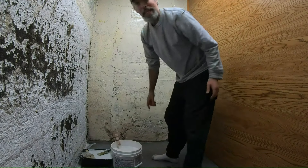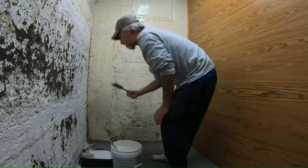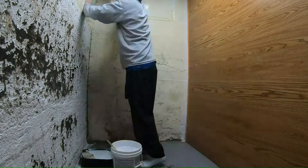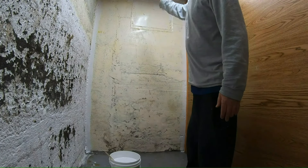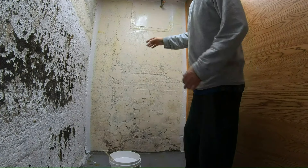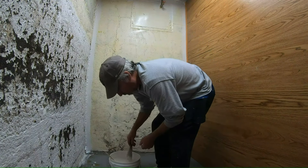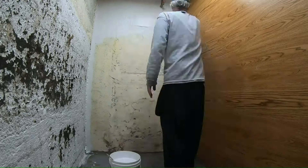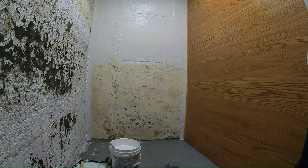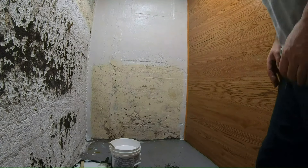YouTubers, I'm going to paint — I'm going to time lapse it, so maybe I'll paint faster. Starting with Drylok to try to keep the water seepage out. You could actually get away with using a roller on this wall because it's relatively smooth, but on rougher walls, just use a brush. I would recommend that if you're doing a pretty bad wall, just use a brush. I'm painting kind of terrible because I'm trying to paint fast, and these brushes — I've pushed them to the edge. They don't have a lot of life left in them, but we're going to keep going.